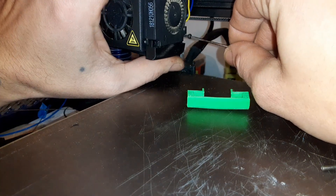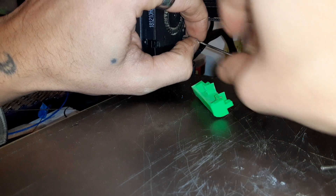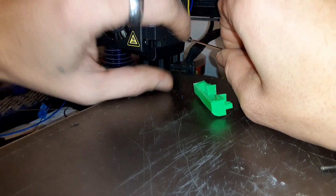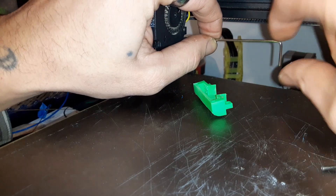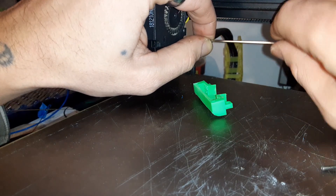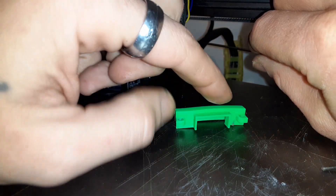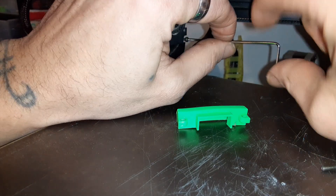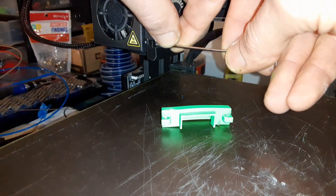I have done it about a million times already and have yet to damage it myself, but I do try to be as cautious as possible. Now, it is very easy to thread this screw in here and not have the vent lined up across the bottom — not actually be in the screw hole and think you are. I think that is one of the reasons my last one hung down too low. But also, this bottom surface has been reduced in height on this one, so I shouldn't have any bumping or scraping. The key is to get it in the hole — I'll do this one I can see first; it should help me line up the other one.